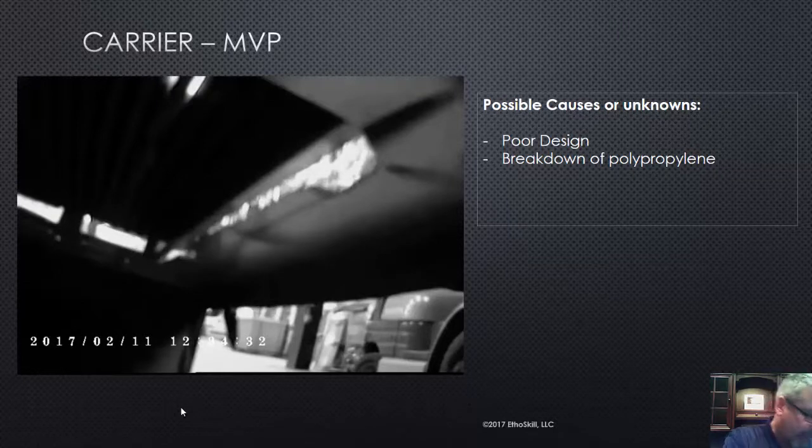Ian, Ben, Brad, and Steve — you guys have been through many of my training courses and know what we're looking at. What we've got is a secondary heat exchanger. That's a polypropylene heat exchanger — it was an aluminized coated heat exchanger built by Carrier. It absolutely had outstanding heat transfer. Great design concept. However, the polypropylene broke down.